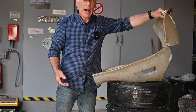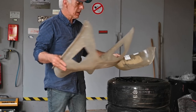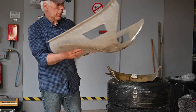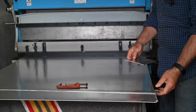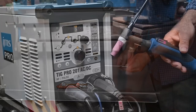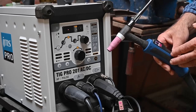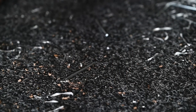I don't know why he did that because to me that was very unsafe, and on top of that the seat was only fixed to the frame with some tie wraps through these holes. So I have already removed that seat. Now we're going to build a brand new seat, and I'm planning to build it with aluminum of 1.5 millimeters thick. I could use TIG welding to assemble the seat but I'm not very good at welding aluminum, so I'm going to avoid it as much as I can.